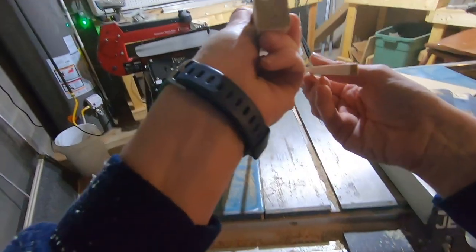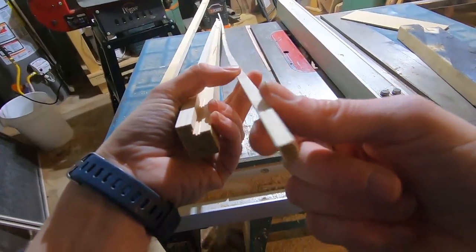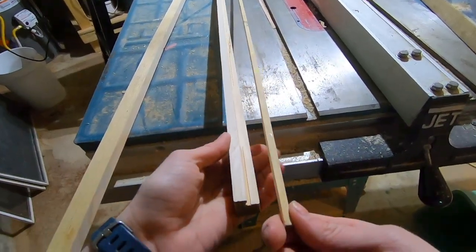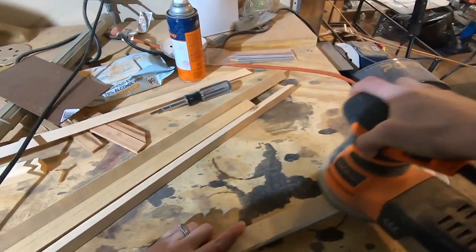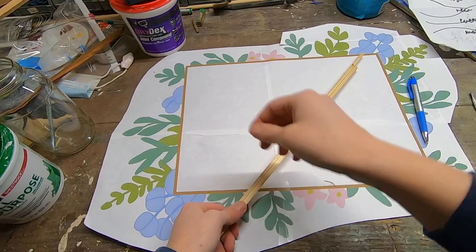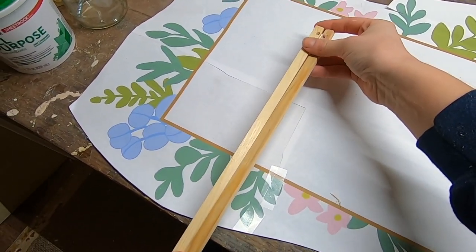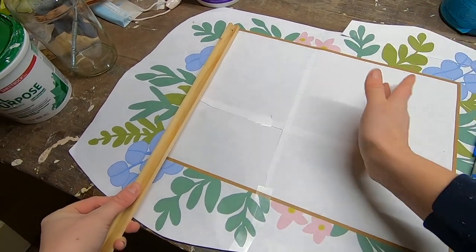I just ran this down the table saw to rabbit this framing and the inside piece right here is pretty small — this is the one I want to use for the inside frame. I wanted to keep the inside frame really small. Feel free to make it larger. I just wanted a thin one because I have a lot of words to stick in the middle of this particular piece, so we want as much room for the words as possible. I've already made the backing and outer frame, and now before I cut this up to scroll, I want to first measure out what my inside frame needs to be before I mess up this template.